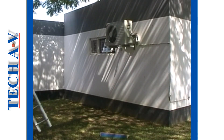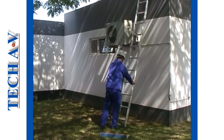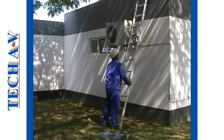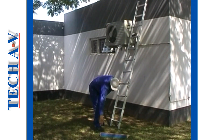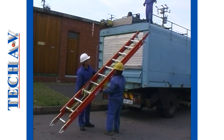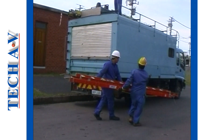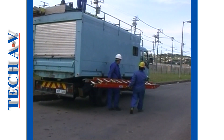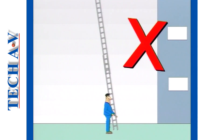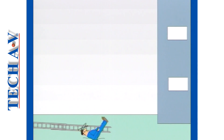The setting up of lightweight ladders presents little problem. One simply carries it into position and then places it against the structure. However, not all ladders — and especially some extension ladders — are that light. The handling and setting up of such a ladder is not a one-person job. You must never raise, set up, or try to reposition an extended ladder, or you will find things getting totally out of control.